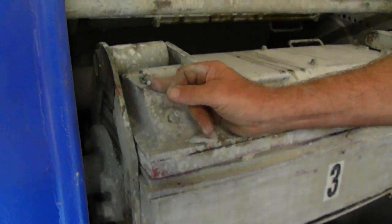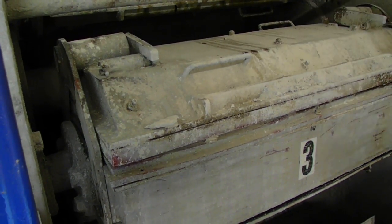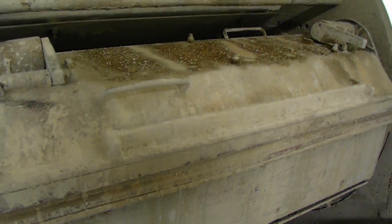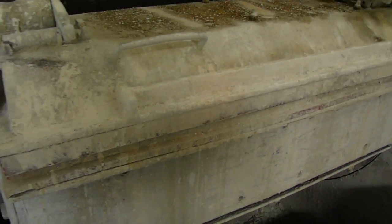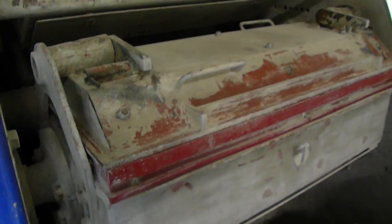Remove the safety latches out. These cam up, releasing the lid to load the parts in or to dump them out. That goes back in. Jog to the next barrel. Rotate it up. Same thing, load parts. Next barrel. Over and over again until they're all loaded.